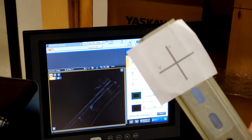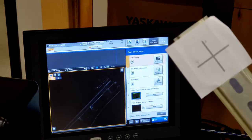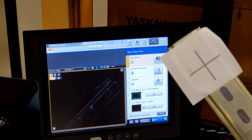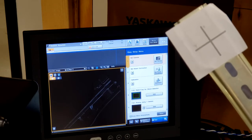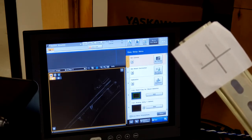In the case of calibration, what you do is just create a printout such as this, attach this pattern to the end of the robot arm, jog the pattern into the field of view of the camera, and the vision system will take control of the robot for the calibration process — jogging this pattern around within the camera's frame of view. That's how it establishes the robot-to-camera system calibration.